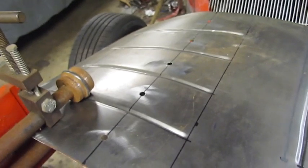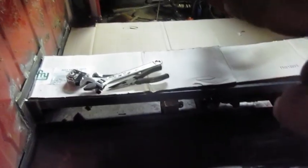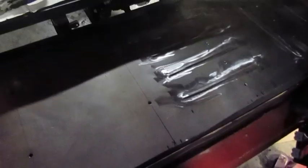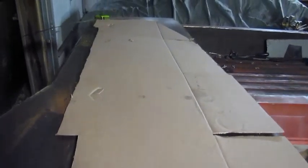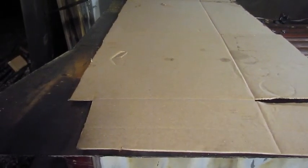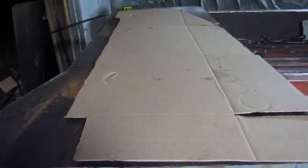I got all the beads rolled in manually and it's ready to put in the truck. Should be nice and stiff by the time I weld it all down — shouldn't have any buckles with these stiffening beads in there. It's a floorboard, so they don't have to be perfect. This side's done with the ribs. I'm going to the other side because I can piece that together from the leftover sheet. I got really lucky — this other side is going to fit in that same sheet, so I might not even need the second sheet I have for bodywork.